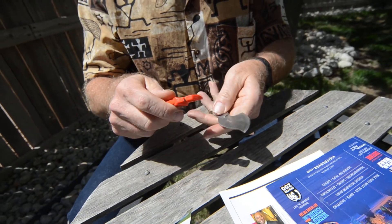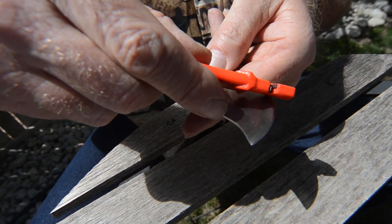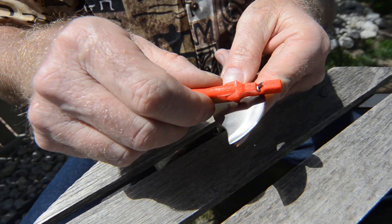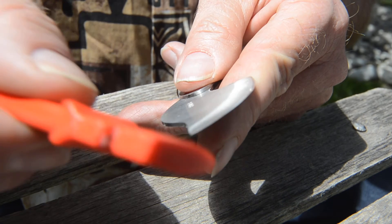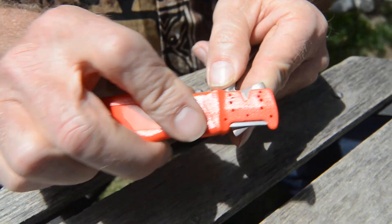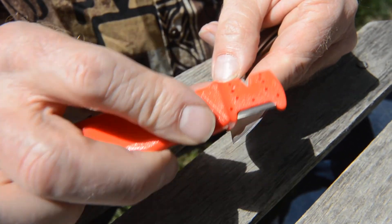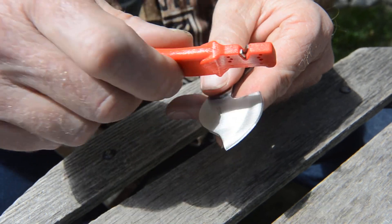So we're going to take that corner and touch the knife on about an eight-degree bevel, just like this. Then we're going to slide it from the back here around towards the tip of the blade, just like this around towards that point. I'm just going to turn and go right on around just like this, turn it over and come back this way. If you tip it up like this trying to get to the cutting edge, you'll actually take the edge off your own blade.